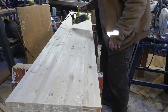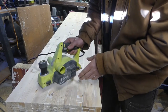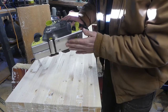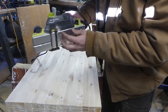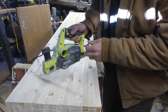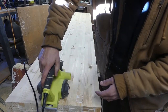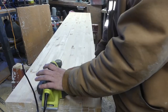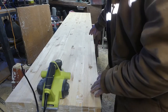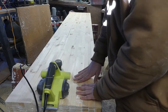I didn't really cover starting off. This one has a little foot in the back so when you set it down the blade won't touch the wood and won't dig in. You need the back to be on the wood, otherwise it will dig in up front. When I'm starting it, I put it on there to about where the foot clicks and then hold down, so my blade is about right here. I'll do passes this way, then turn around and do passes that way — that keeps the ends about where they should be.